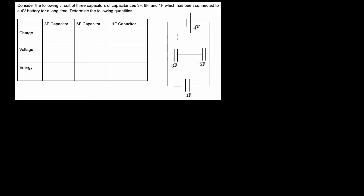You look for if there's any that are easy, and there's one in here that's very easy to deal with. The capacitor that's easiest is this one farad. The reason is I can draw a loop — I can go from here through the battery, through this capacitor, back home, and I only went through the battery and one capacitor. That just means the voltage across this one farad capacitor is four volts. Finding voltage across the one farad capacitor — easy.